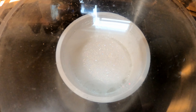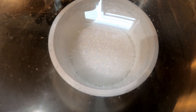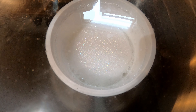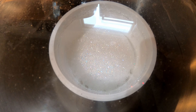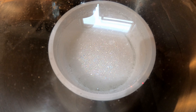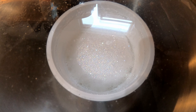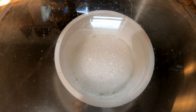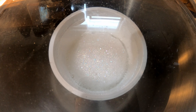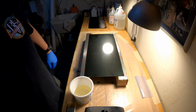I lifted the lid and just used the heat gun to heat the surface up a little bit. Above 100 degrees is where all the magic happens — you can see now that it's popping like boiling water, just like it should be. You can spray a little acetone on it or just use a heat gun to break the surface tension. Once the resin has risen back down, it is time to start the layup. The resin is nicely recovered — not a bubble in there.